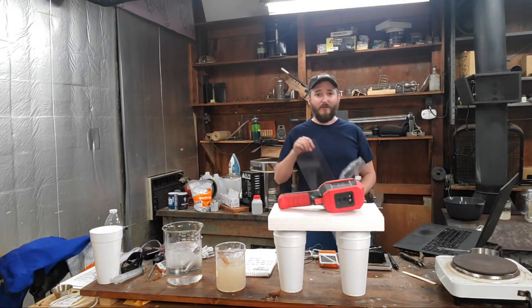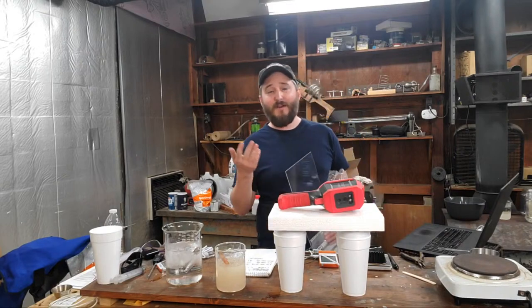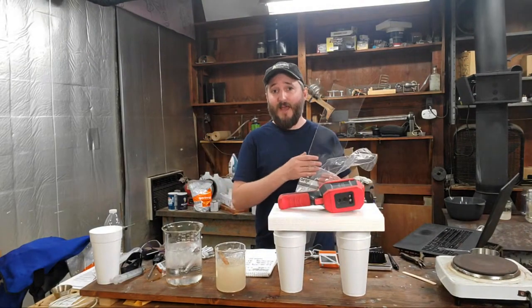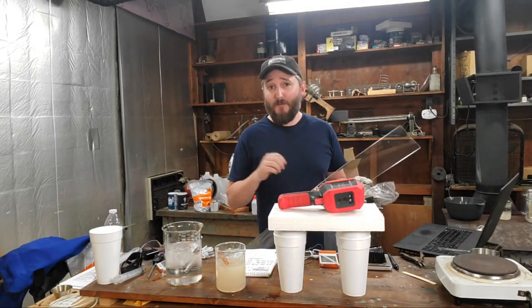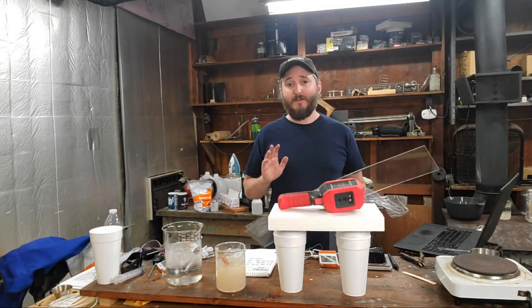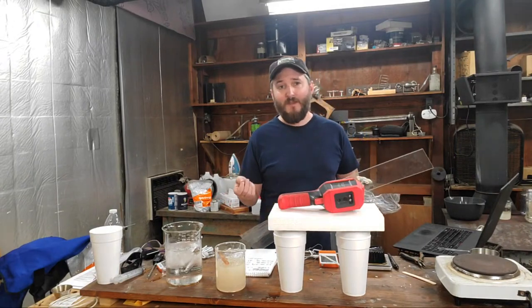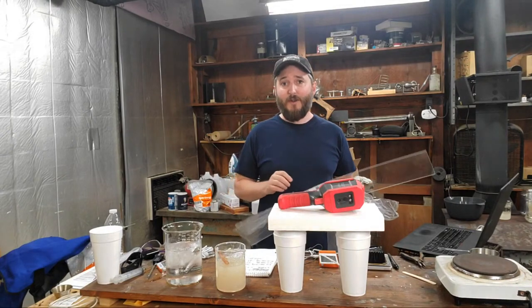And I found that the acrylic mixture, with the snow scattering effect, where you mix this in acetone and add a little bit of water, is the primary component of the radiative cooling, making that ultra white coating. And the pigment, I've spent a long time making a really good pigment. That is actually the less important feature of the radiative cooling paint.